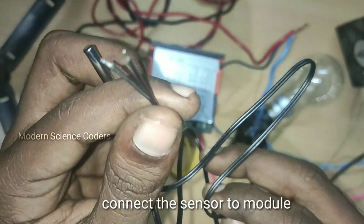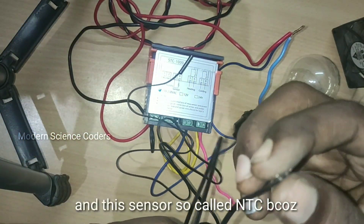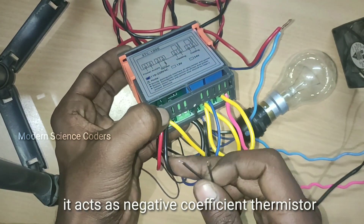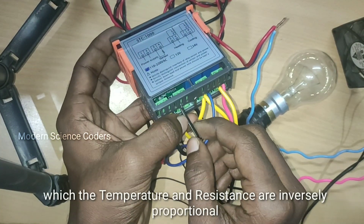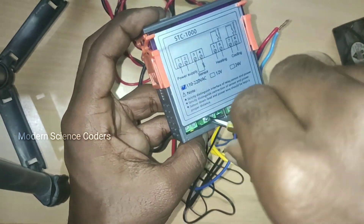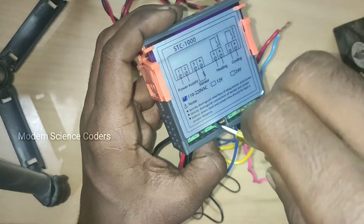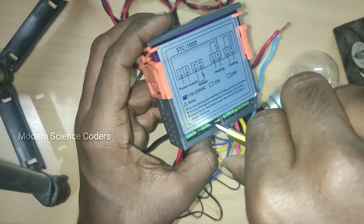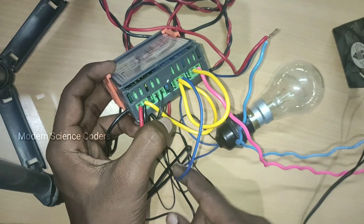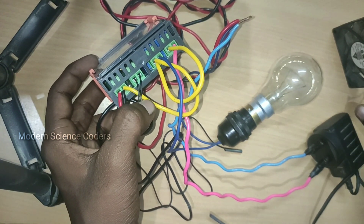This is how we connect the temperature sensor. This temperature sensor is an NTC sensor — that is a negative temperature coefficient sensor. If you use a thermistor for a different purpose, it will be different from temperature. The negative temperature coefficient means if you increase the temperature, the sensor resistance decreases. If you use the current through the sensor, it will have a low temperature reading. I will use this data and use the fan accordingly.